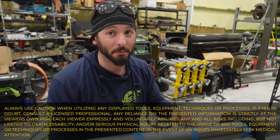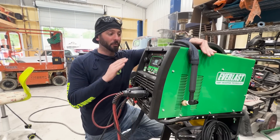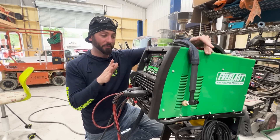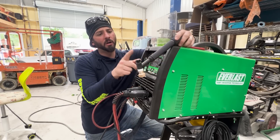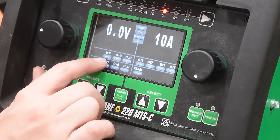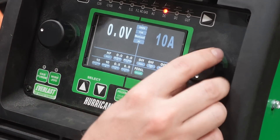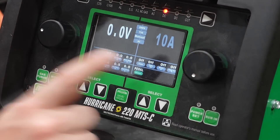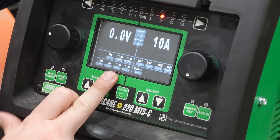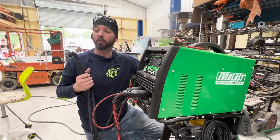We've got some good fits and some bad fits, but before we do anything let's go over to the Hurricane and set it up to weld. We've got the Hurricane 220 MTSC — we've been using this machine on this entire build for plasma cutting and MIG welding. We've been tack-welding with TIG using the hot switch, but we took the remote off the torch and put the foot pedal back on for more amperage control. We've got high-frequency start, no up or downslope since we'll control that with the foot pedal, switched to pedal mode over 4T/2T, start and end amps as low as possible, pre-flow at half a second, and post-flow at six seconds. We've got the exhaust over here with the purge on.